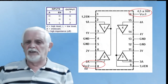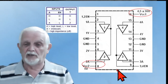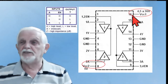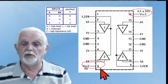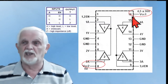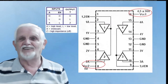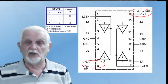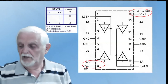I've taken this out of a magazine, and the reason is I've circled two things because they've got it the wrong way around — they've said you can put up to 36 volts on VCC1 and five volts on VCC2. If you try that, you've just blown the chip, because five volts max is what comes into VCC1 to power the logic. This is just to remind you that not everything you see on the internet is true. It pays to download the spec and look.